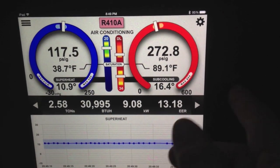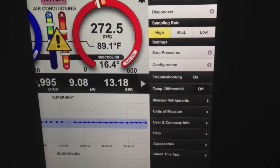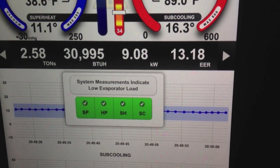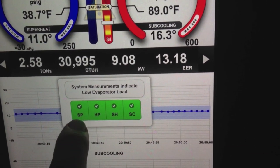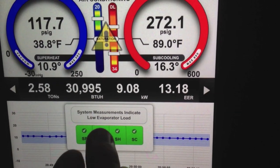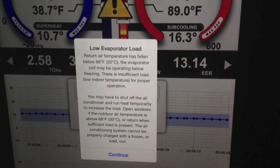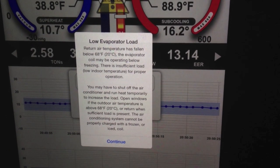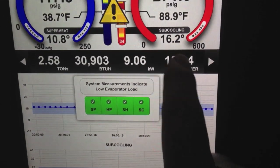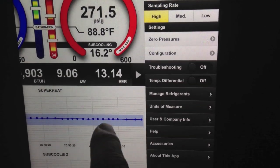Right now, just of interest, let's see if it kicks out a flag on troubleshooting — I pretty much guarantee it will, just because I know it's so cold in the house. Turn on troubleshooting, and you can see right away we get the flag — something's wrong. What's wrong? System measurements indicate low evaporator load. Notice, though, everything's green — suction pressure's where it should be, high pressure's where it should be, superheat and subcooling are right where they should be. We just have low load, and that low load is due to the low evaporator temperature. Now this is where we typically see TXV hunting because of the low load, but this one just seems to be controlling really well. So we tap that, hit continue, and get rid of the flag. I'm going to turn troubleshooting back off.